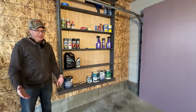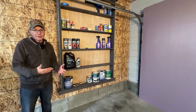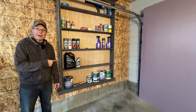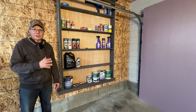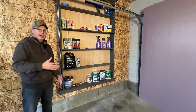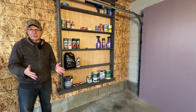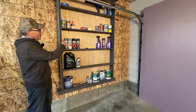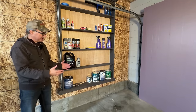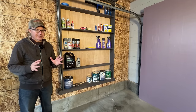The third reason the Smart Shelves 2.0 are better is that even though they're stronger, they're lighter weight. MDF weighs a ton, and the plywood was lighter even though it was thicker. Additionally, I scaled back the depth of most shelves — the originals were about seven and a half inches deep, but I made most of these six inches. I kept the bottom shelf at seven inches since that's the right depth for a paint can, but it lightened up the shelves considerably.